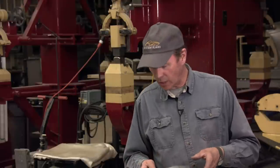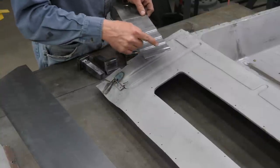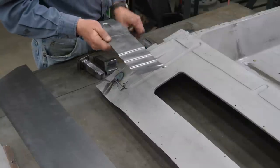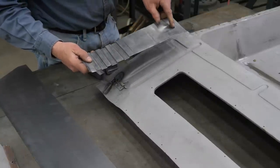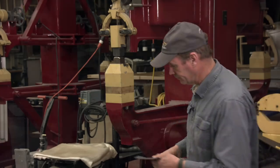We've run some preliminary tests without the linear stretching die just to make sure that our dies were the right size. Here's our straight through. Ran this in here several times. I was playing here with the sides and the distance between the two dies. And then here is our test for the end, and I think it's going to work just absolutely perfectly. But what we need to do next is go stretch a panel and then run it through the Pullmax machine and see how smooth our metal is on each side. So without further ado, let's make some noise.